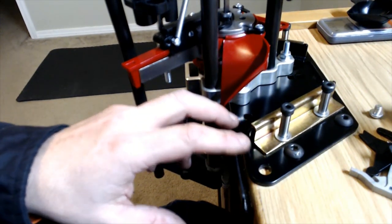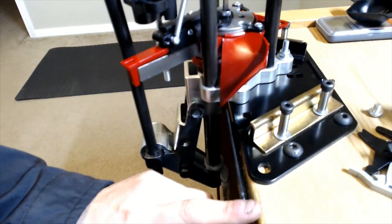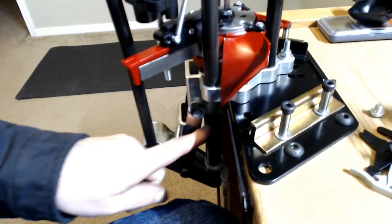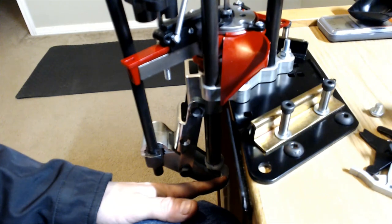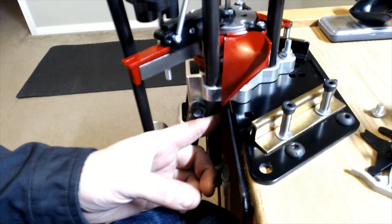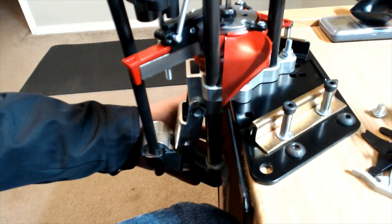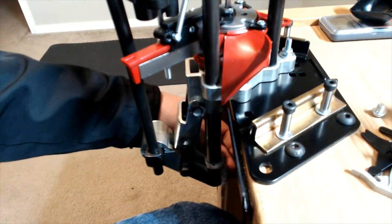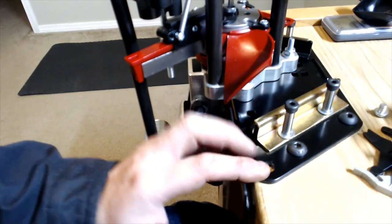When you go to mount the bench plate to your workbench top, you want to get this edge as close to flush with the edge of your workbench as possible. You might also give it a little bit of an overhang, and the reason for that is so that you have clearance for the central ram and the decapping tube. I've seen some people who actually had to cut notches out from under their desk just so they don't accidentally catch the decapping tube and break it off — it's just held on with a little plastic ring and is quite fragile.